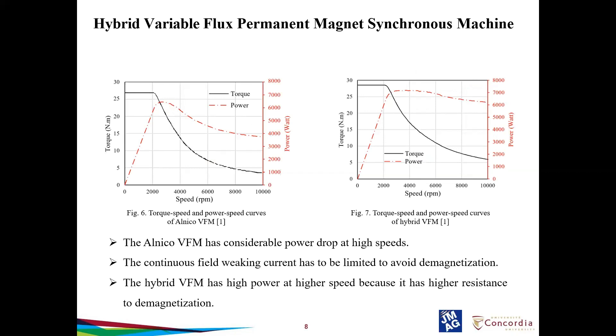The next section covers the torque-speed curve for two machines, shown in figures 6 and 7. At low speeds, the maximum torque per ampere (MTPA) method is used, where the current magnitude is fixed and its phase angle is varied until maximum torque is obtained. When the machine exceeds its base speed, the torque-speed curves are calculated using the maximum power technique, where both current magnitude and phase angle are varied to maximize machine power while maintaining terminal voltage below the drive system capability.